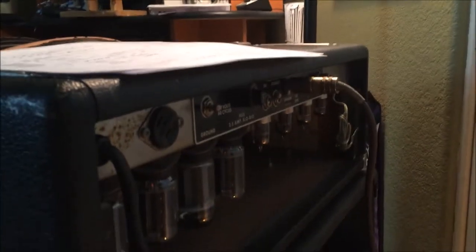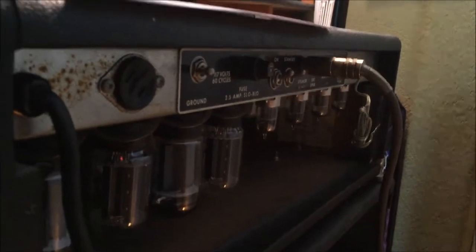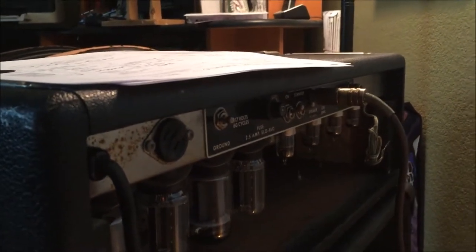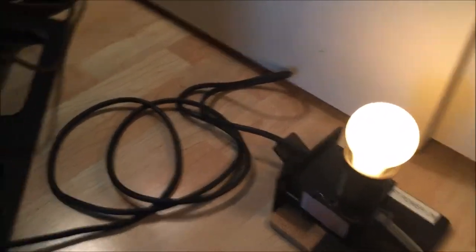We have sound — it didn't blow up. What I did was keep putting progressively higher wattage light bulbs in and powering it up, letting it sit for 15 or 20 minutes each time. I started with a 40, then a 60, then a 75, then a 100 watt bulb. The 100 watt was when I tried firing it up with all the power tubes and preamp tubes in, and it didn't blow up. I've been playing it for about half an hour. I had to turn all the pots back and forth about 20 times to get rid of the scratchiness since they hadn't been used in years. My hunch about firing this up without a Variac — just using the light bulb current limiter — worked out very well.